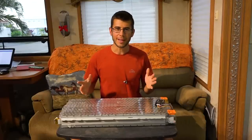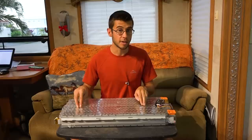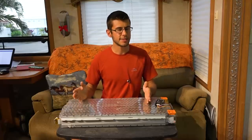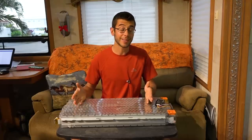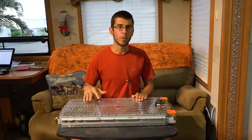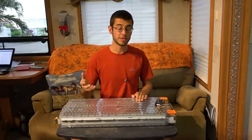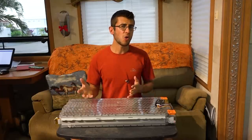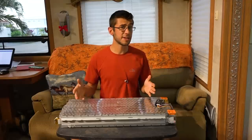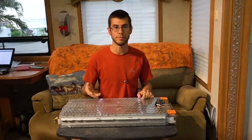So what about how long this battery might last? Tesla warrants the 85 kilowatt hour battery for eight years in their cars with unlimited mileage. Based on Tesla driving data, they're now estimating these batteries might last upwards of 20 years in the cars. We're going to be cycling this battery a whole lot more, but we're hoping to get a couple thousand good cycles and upwards of 10 years of battery life in our RV. Over time lithium ions do degrade, so we'll see how performance holds up — but we're definitely excited to see better longevity than our lead acids in the past, which lasted upwards of two years maximum.